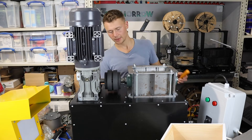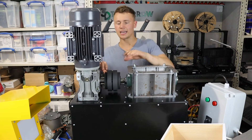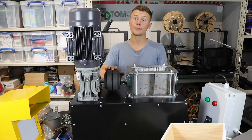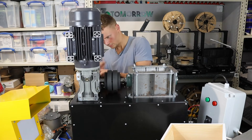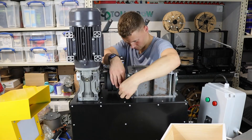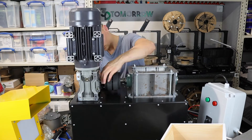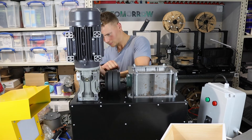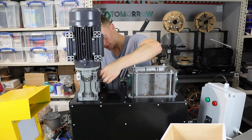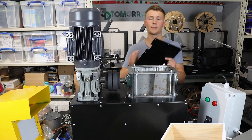Now sort out the couplings and join them together. The key is to get them both level with a slight gap between the two couplings, and that gap needs to be even all the way around the circumference. Once the gap is looking pretty even, tighten up the grub screws. That's all bolted up, so I can go ahead and put the final metal panel on.